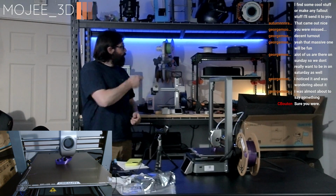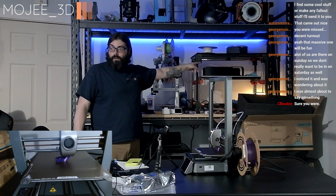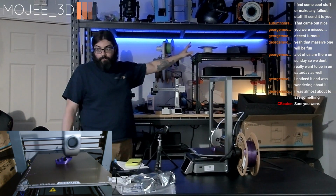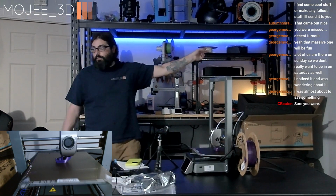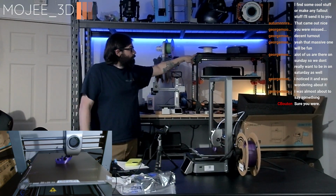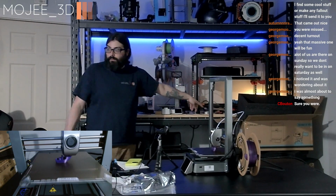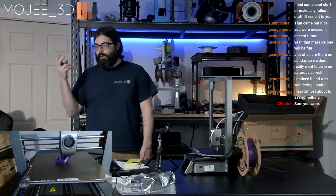And that'll be fun. And I don't know if you guys can see, it's got four motors. So it's CoreXY, but it's all-wheel drive. So instead of just two motors, it's four. So you can really crank them up. I'm making a custom carbon fiber gantry for it, and the gantry is based off of a VZbot design, and then the bed and the bottom motor mounts are similar. The designs are based off of a Rat Rig V-Core 3.1, I think it is.